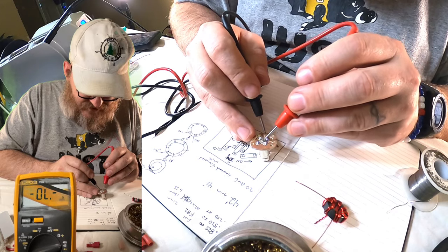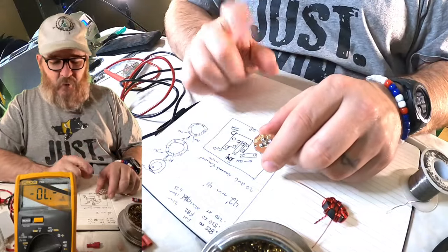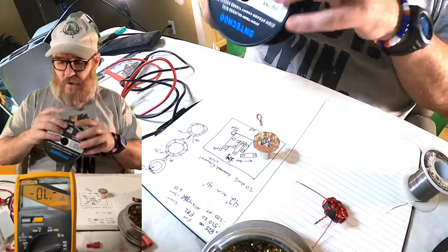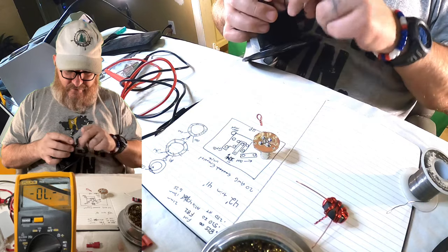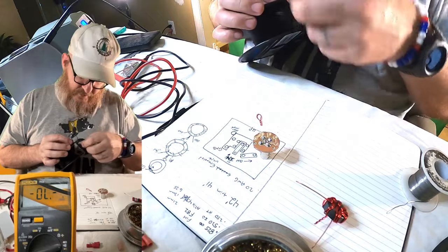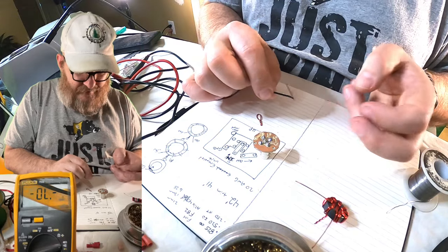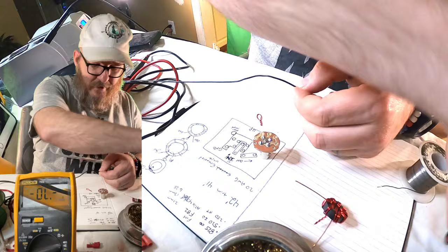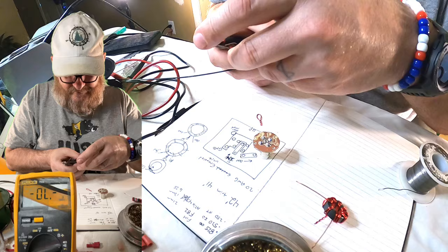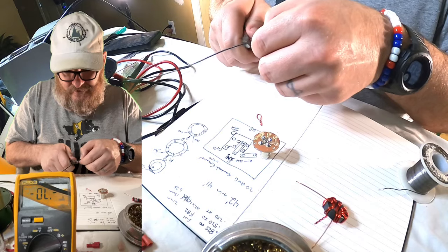As far as the input, there should only be one — yes. So we have done very well thus far. Now here is what we need to do next — we need to make two jumpers for our wire. These are going to be about two inches long each. These are going to be your antenna and your counterpoise.